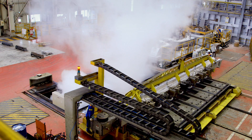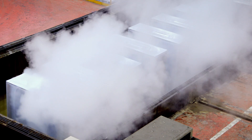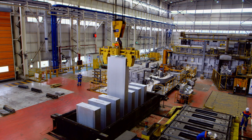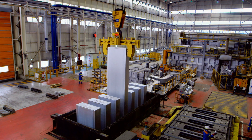Water is then used around the hot metal to cool it down. The molten aluminium is eventually formed into large blocks called ingots. Each of these ingots weighs 27 tons — that's the weight of three buses and enough metal to make 1.5 million more drinks cans.